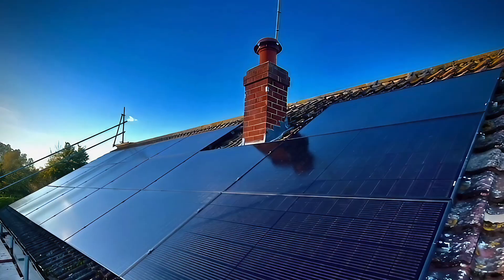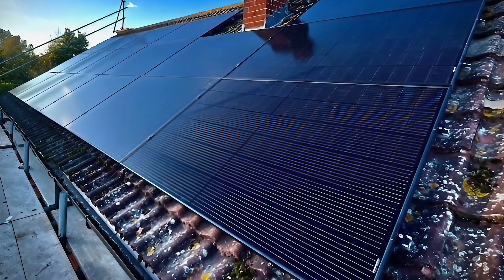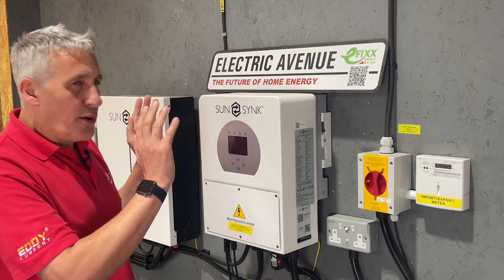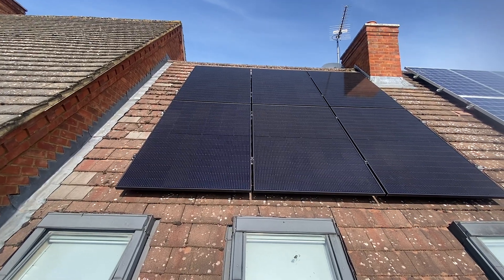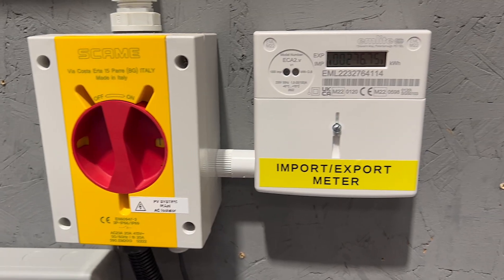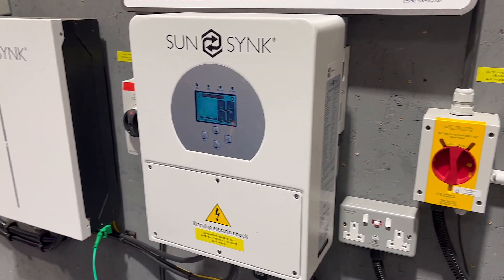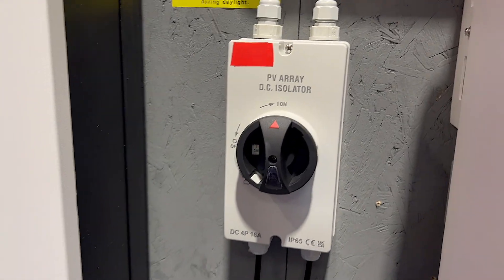In this video we will explore whether a residential solar panel installation in the UK needs to be fitted with an export meter. The solar installation you see here follows a well-established norm that you'll see on most residential UK solar installations: an isolator on the AC side, followed by a generation meter feeding the inverter, and a DC isolator connected to the PV strings — and we've looked at that in a separate video.